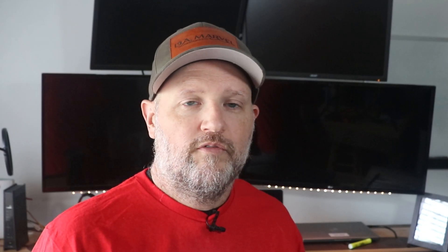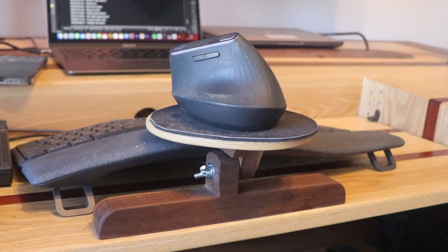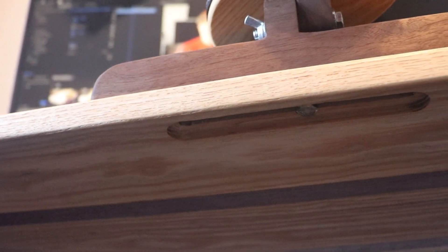The keyboard shelf uses adjustable shelf pins. The holes for the pins are in two rows — the holes are an inch apart, and the second row is offset by a half an inch, so effectively I can make adjustments in half-inch increments. The mouse stand is the most unique thing about this desk. Coupled with a vertical mouse, it helps me avoid the shoulder issues I dealt with in the past. It has a tilting adjustment so I can tilt it to level even when the keyboard tray is not, so the mouse doesn't slide off. It can also slide left or right depending on the keyboard or other devices on the keyboard tray.